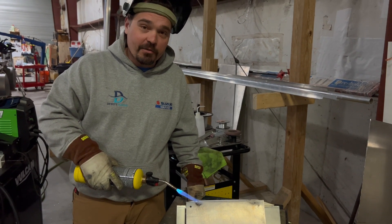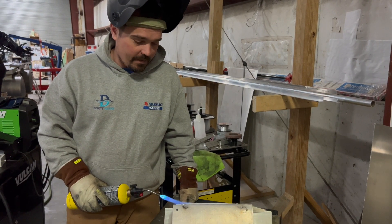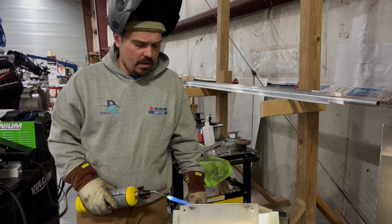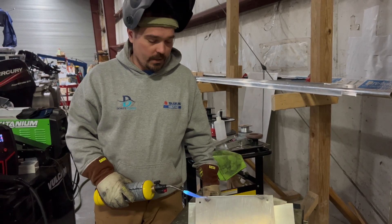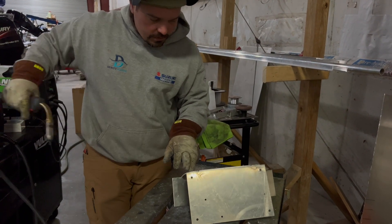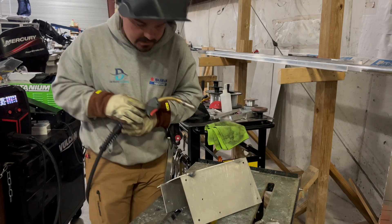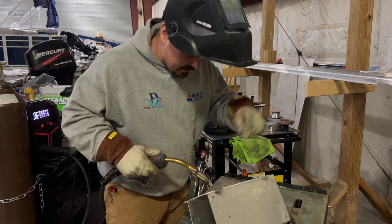I haven't played around with this a ton, and it's been a little while — this is actually the first time I've had this welder out in a month or so. That first fillet joint was a little unnerving thinking wow, I haven't welded in a month. We just weld when we need to, building boats for fun. I'm going to run right over top of this tack I laid in here, starting my weld in this open gap, and then run through. Not a good start — I blew my tack apart. Dropped it down to 17 volts and 90 amps.